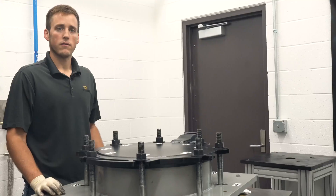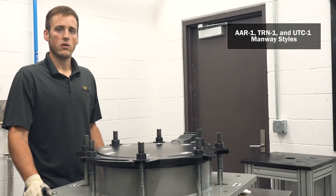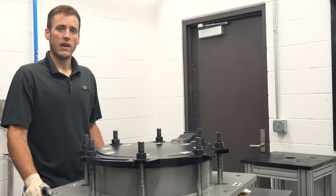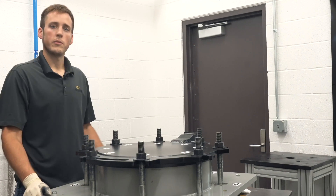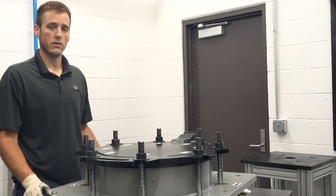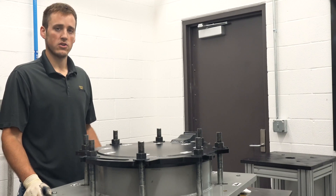The guidelines I'm following are for equipment that uses AR-1, TRN-1, and UTC-1 manway styles and 1 inch ASTM A-307 grade A bolts. If your equipment uses any other bolt type, be sure the torque does not exceed 60% of the bolt yield strength. You can find that yield on the bolt supplier's specification sheet.